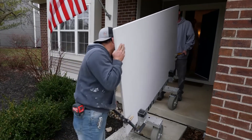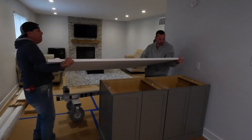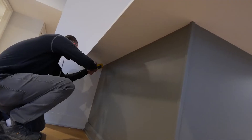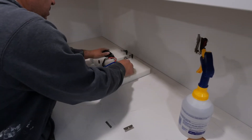So what can we expect when you guys physically bring the stone in here? That's where the manpower comes into place. We run a team of about two installers depending on the size of the job or if it's a large island. The day we come in here, nothing's really changed from the aspect of cabinetry layout — we're ready to install the countertop. We would essentially roll them off into the kitchen, lay them in place, shim and level them, seal them down, put the seams together, and drill any faucet holes or things like that if they haven't already been done in the shop.